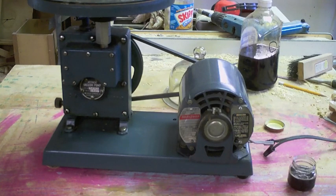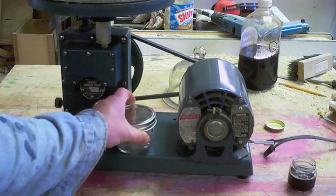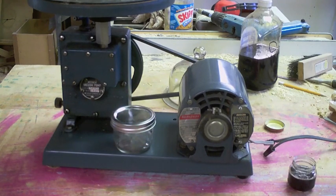What if you don't have a big vacuum pump? Is everything I just showed you useless? No, it's not. In fact, you do have access to essentially a vacuum pump — they're cheap, they're easy, and there's probably one in your cupboard right now. All you need is a simple run-of-the-mill canning jar and lid. Put your oil in, put your bearing in the oil, and boil it just as if you're canning carrots. Once it reaches temperature, take it off, screw the lid down, and set it aside. As it cools, it pulls a vacuum — that's how canning seals work. Wait for it to be fully cool, pop the top, air rushes in, and your bearing is greased. Each and every one of you can do this at home and save a bearing. Thanks for watching — hope you find this helpful. Good luck with all your projects.